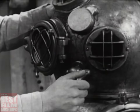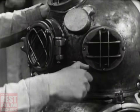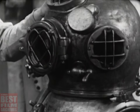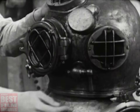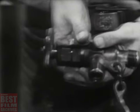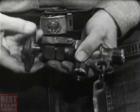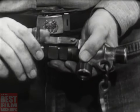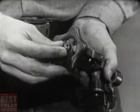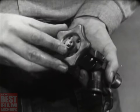Next, the spitcock at the left side of the helmet. This is a secondary exhaust valve used to make minor adjustments in the diver's buoyancy. It's a simple sleeve valve. The only test necessary is to operate the lever, making sure that it has enough turning resistance to remain fixed at any setting. Now let's look at the remaining two valves, each concerned with air supply. The air control valve regulates the amount of air admitted to the diving dress. The regulating hand wheel should turn freely so that the diver has no difficulty making adjustments in his air supply. However, it must not be loose — enough resistance must be felt to prevent an accidental bump or blow from turning the hand wheel and altering the diver's buoyancy.